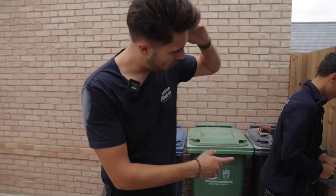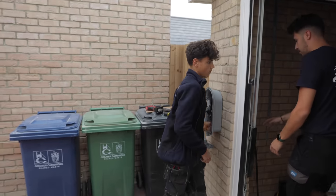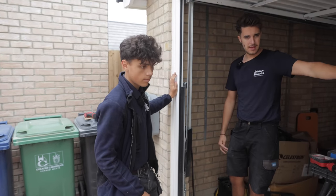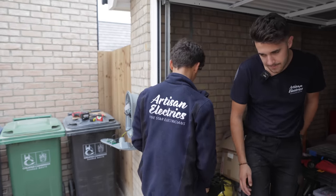That'll need to be a 25mm hole with a stuffing gland. 25mm, right, okay. Yeah, and also I wouldn't poke the cable through yet because the hardest bit is going to be getting through there, so I'd get through that hardest bit first. Right. And then we'll measure it off and get it all in. Nice. But I like your proactivity.